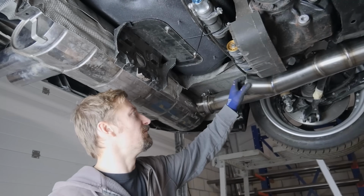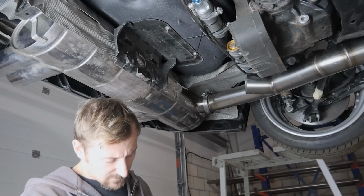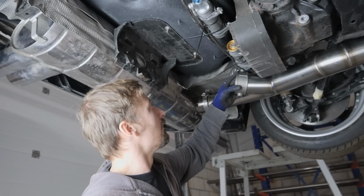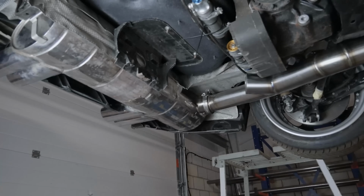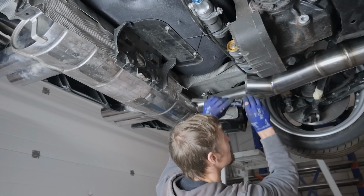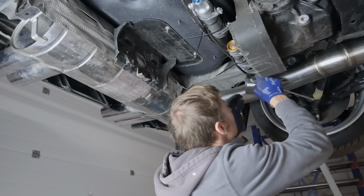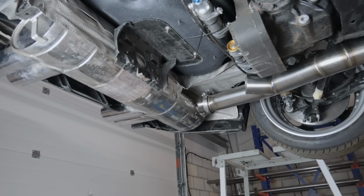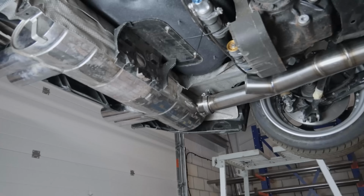So got that pipe refitted now with the merge welded into it, but this valve is a touch too big, so it's making it quite hard to line it up nicely on that piece of pipe. When I've got the pipe pushed into it, I can't see if it's square on or not. So I'm just going to mark around the tube with an old set of verniers, like an offset line, so I can line it up with that offset line, and then I'll know a lot better than guessing that the valve is actually square on the tube, and I'll do the same on here as well. And then it's just a case of welding this valve up.